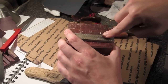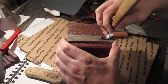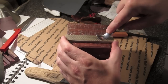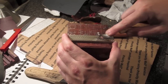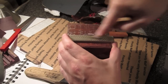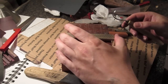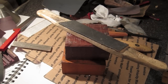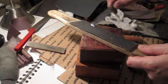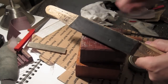You want to keep the knife thick — it's very important. These tools are really long, a lot of metal, and carbon steel is springy — it's used as springs. When it's too thin or the ratio is off, when pushing hard it twists or bends and the edge isn't pointing forward anymore, which causes bad results and it won't carve. So you have to make them thicker. After having a quality knife and shape, the main ingredient is thickness. Mora does make a spoon knife but it's notoriously disappointing compared to their straight knives, which almost nobody has bad things to say about.